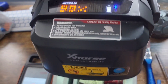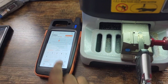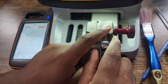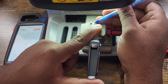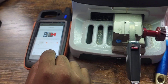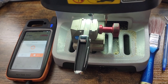It's done now on one side, so you have to just brush off the excess shavings. It should look exactly how it looks in the picture. Then you have to flip it around and make sure that it's lined up to the edge. For certain keys, it lines up a certain way, but it will show you on the computer on the X-Tool. Then you hit continue and it will start cutting the opposite side of the key.